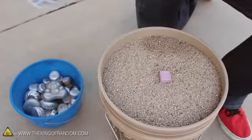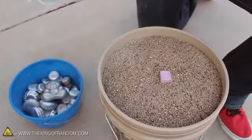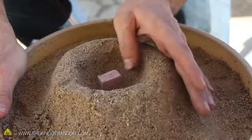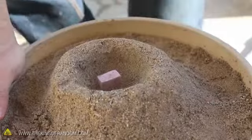It's a good idea to have a little spray bottle handy, so you can spritz some water and moisten the top layer of the sand. This way you'll be able to build a volcano around the foam riser, to act as a funnel leading down to the styrofoam.